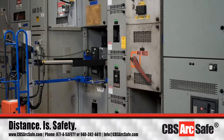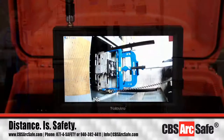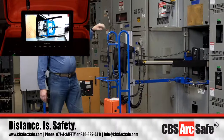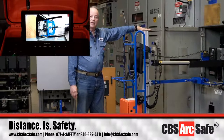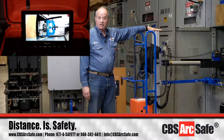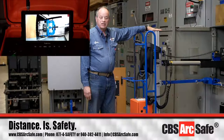The wireless video system — somebody says, 'I've been doing this by hand for the last 30 years, Greg, I can't see what's going on.' The whole purpose of this is so that instead of being right in front of the cubicle, you're able to focus it on things like the interlock on the side to monitor the progress of the racking, both in and out. On rotary breakers, only about 10 to 15% of the time does a customer need a video system. On the RRS2 type of breakers, that number is almost 100%.